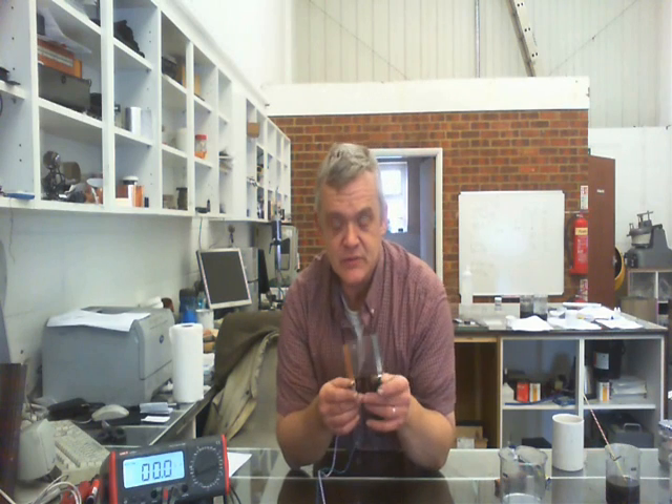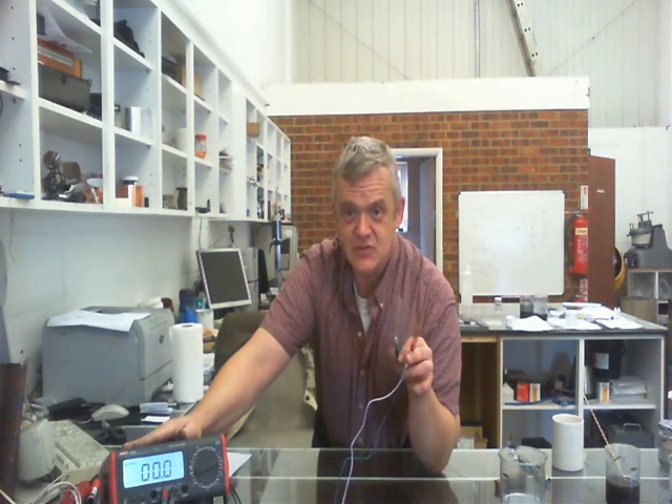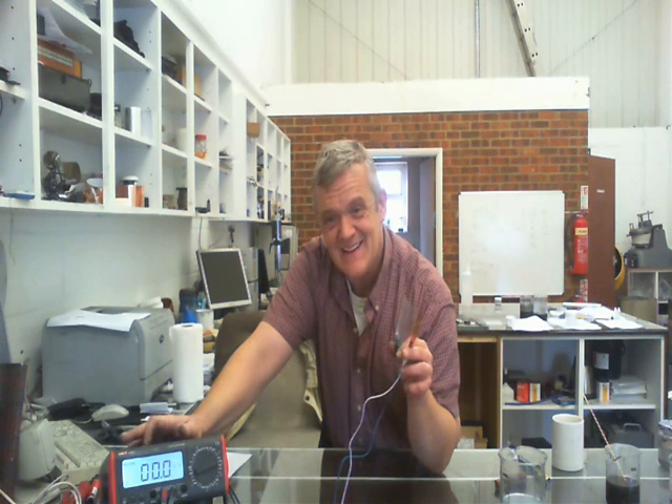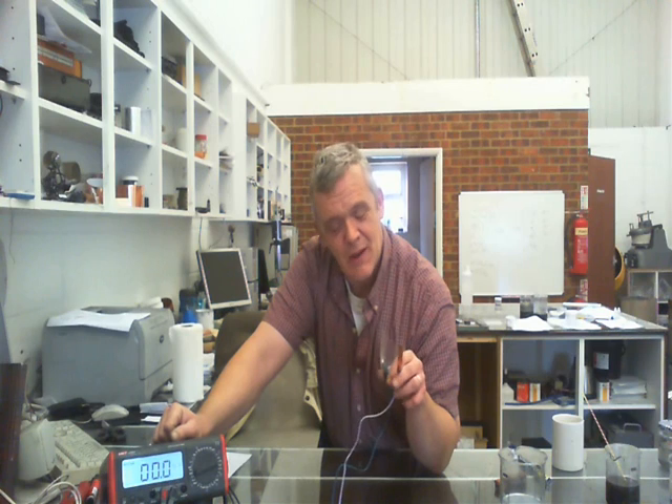And then I put down the actual electrode strips and just doctor-bladed a coat of it on there, which is why you can't see anything — it's amazingly thin. Now I've got it connected up on the meter here and it's in microamps. You can see that under the fluorescent lights it's actually astonishingly disappointing — it's generating a tiny, tiny bit. I looked at that and thought, oh dear, that could just be noise; that's not very good.